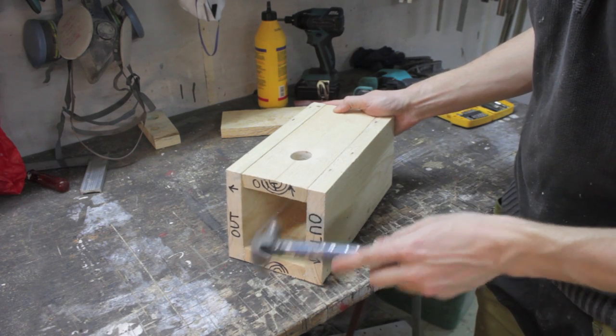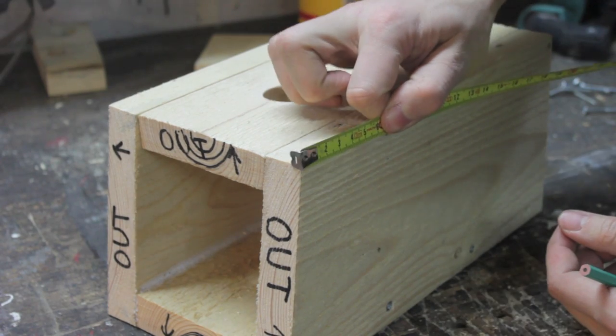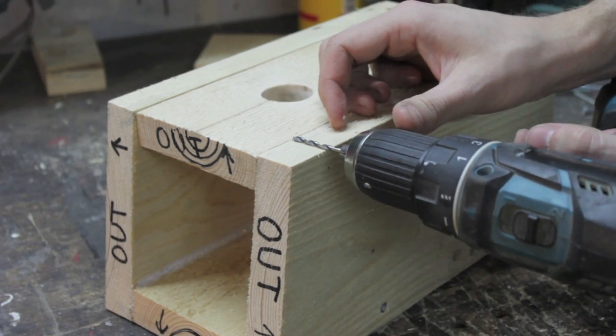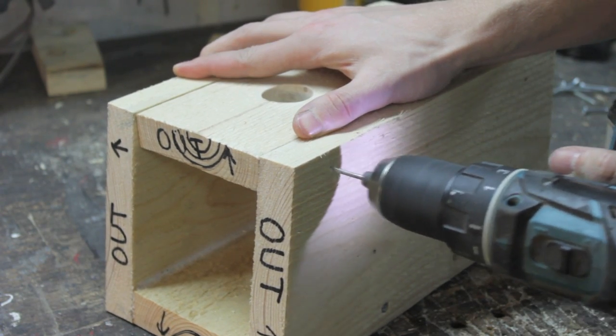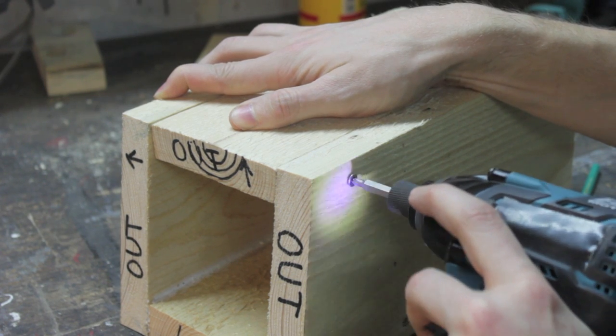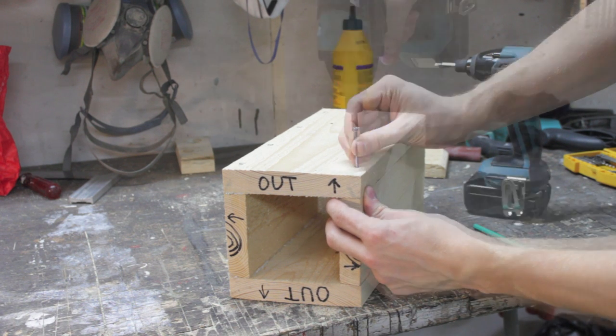Cleaning and maintenance of a birdhouse is important. Old nesting material can hold parasites and moisture, making the birdhouse undesirable to the birds and increasing the likelihood of it falling apart in a matter of years. Having the front wall hinged on a couple of screws is one of the easiest ways for gaining access to the birdhouse when you're high up on a ladder.